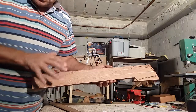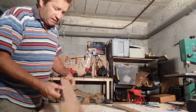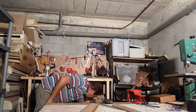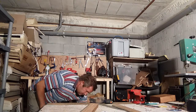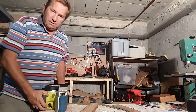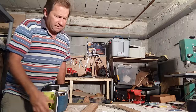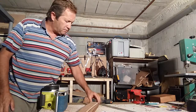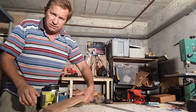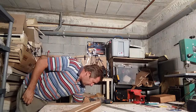Okay, so once that's cut out, the next stage is to get the belt sander, the vertical belt sander, as I said in the earlier podcast. I'll just get the belt sander so you know. I made a piece of wood that fits under here, and a piece of wood here, which is like a guide. So you screw your template back onto your wood once it's cut out, and then you clean it up like this, all around the edges. So that's the next thing I'm going to do. I'll do that on my next podcast.